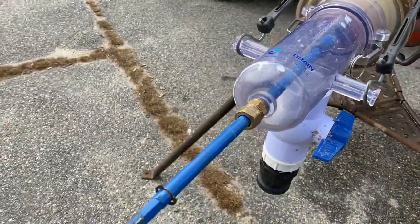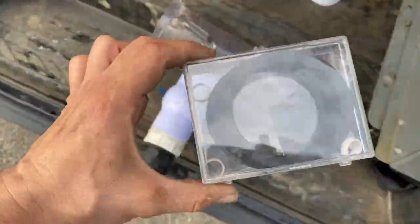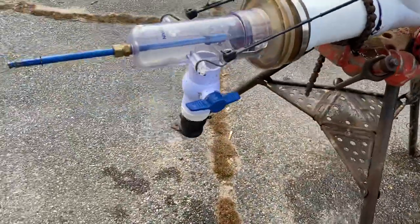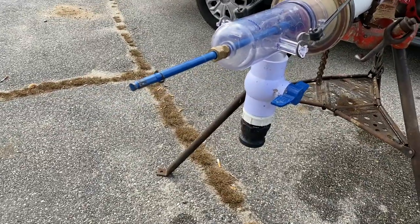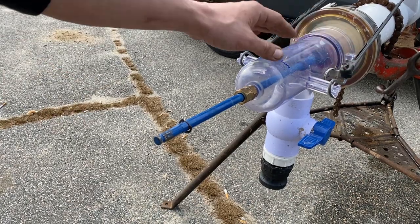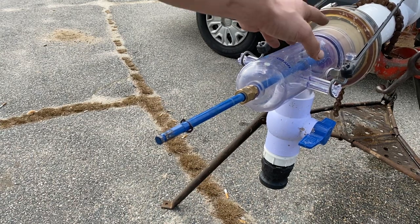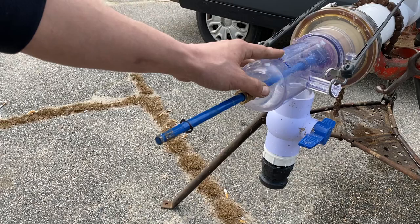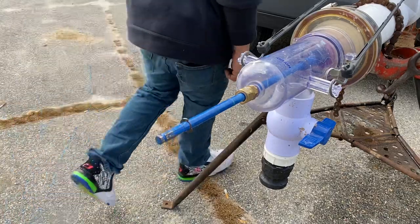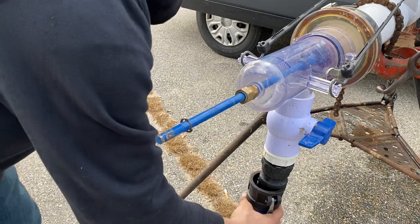That's all you need to get it set up — very simple. You want to make sure it is tight. They do have a kit that it comes with, with all the different attachments and grommets. Make sure it's tight so you can get your drill on there and begin spinning to take out the clean-out cap. Once you get into the clean-out cap, with a pressurized line the flow will come in here, and you're able to control the flow with the shut-off.